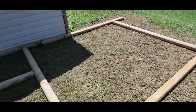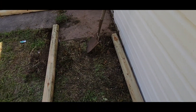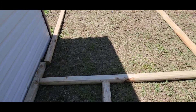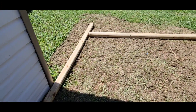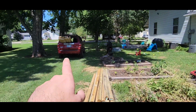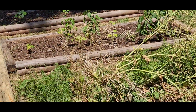I'm just kind of mapping this thing out with my mind's eye. I'm gonna put that planter somewhere right around here, put a beam and create a ramp that comes up — a nice little ramp in case the next person that lives here is wheelchair bound, or so my kids can roll a skateboard down it and break their arm or something. This is gonna be the center beam right here, and we'll come out a little further, butting up close to the beds on the property line. I'm doing it all with eight-foot two-by-eights, untreated — cheapest option — and I'm going to treat them with tung oil.